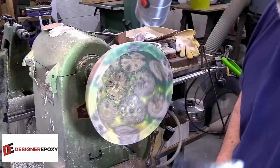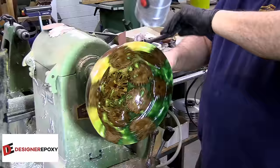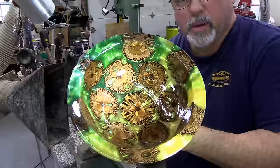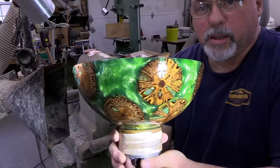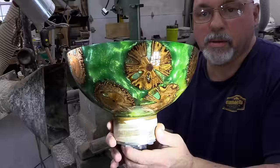For sanding I'm using the three and a half inch nipple discs from sandpaper.ca. I'm only going to sand from 60 to 180 because we're going to do an epoxy coat on this. I just couldn't thin this out and lose that rim detail. This is three ounces of the pro series applied with a silicone barbecue brush — I use a silicone brush because epoxy will pull hairs out of normal brushes and leave them in the piece. Then I rub it in with my glove and don't forget the torch.